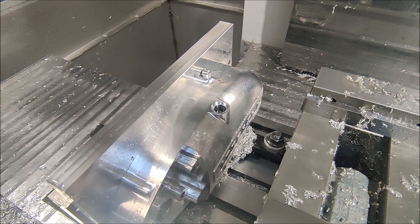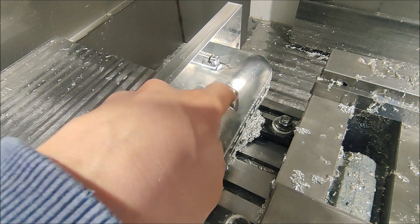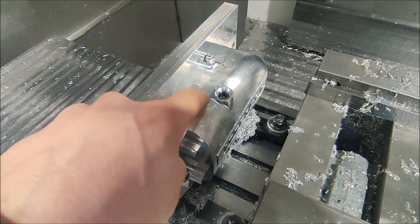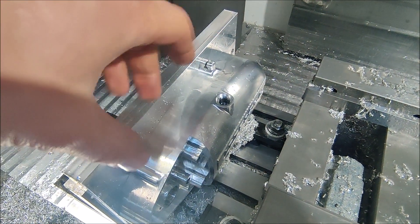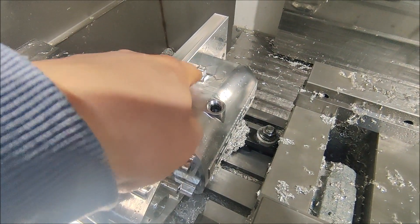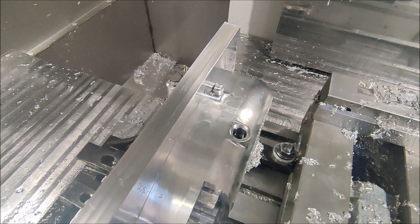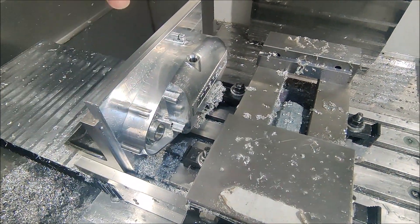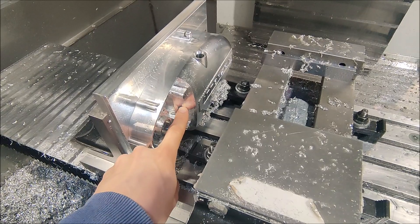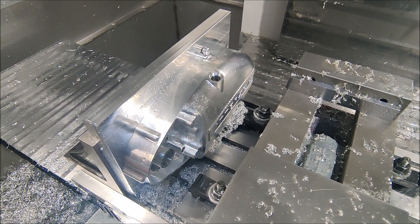The features on this side have now been machined - machined the hole, the flat spot for the o-ring, and a hole that will hold the spring. So the clutch handle will come back and machine the slot where the cable can go through. The next step is to tilt it all the way back up because I need to drill a hole from here where the clutch adjuster will be mounted.